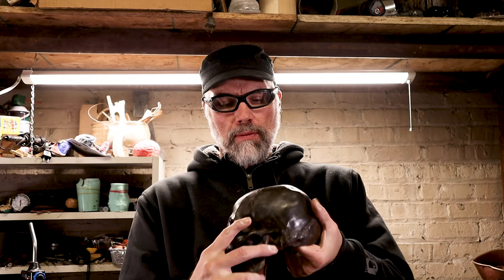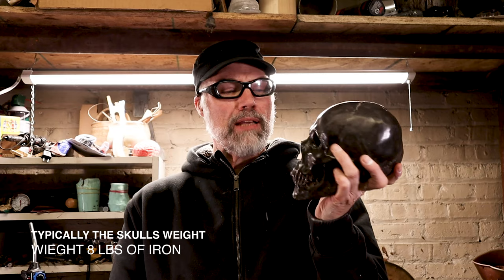As you've seen from some of my previous videos, I've been talking about casting this skull. This is one of the finished cast iron pieces I've done. For the most part we've been focusing on lost wax casting, and the reason why we typically like to use lost wax is that burning out wax is very consistent. It's a nice easy material to make patterns out of from rubber molds or plaster molds — the wax generates a very nice pattern. They're also easy to sprue, work with, and manipulate, and if you're going for consistency, that's still the way to go.